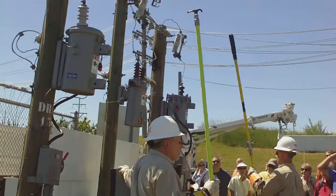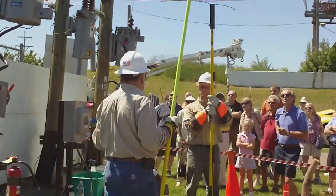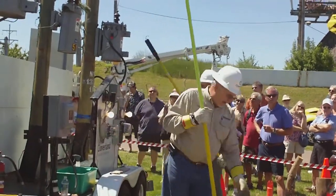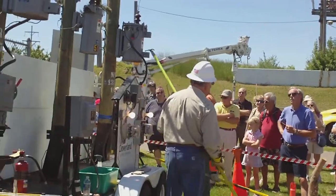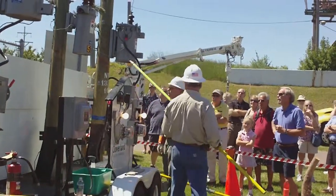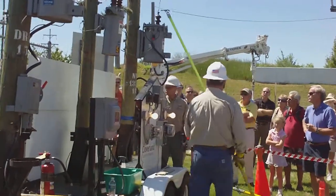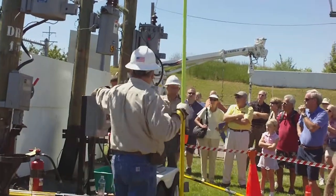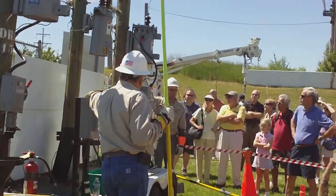Now, point being, if you see damage to our poles, damage to our insulators, tree damage and stuff like that, if you can call it in to us, we appreciate it. We're not everywhere all the time, but if you can call it in, take a look at that pole, see if there's some numbers and letters on it. And tell us what NY3 is. Okay, the NY stands for the Newberry Substation. And this is the third line that comes out of that substation.